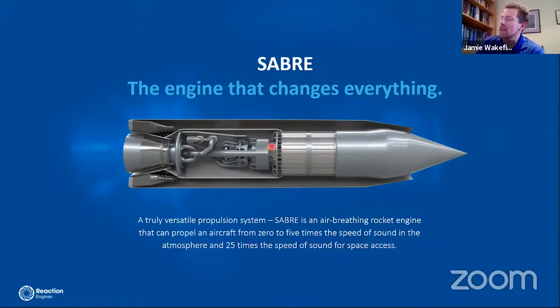We have a helium loop running for our pre-cooler, which extracts heat from the thousand-degree air. We use this hot helium to drive our turbo machinery in the core engine. We've also got enough heat left over in that helium to re-inject heat back into the cryogenic hydrogen and boost the amount of thrust we can get out of it. This regeneration of waste heat has been a big part of what I've been working on as a design engineer at Reaction Engines.